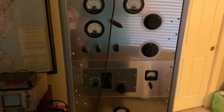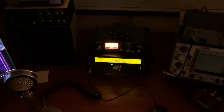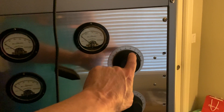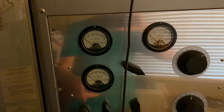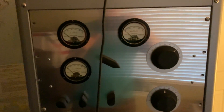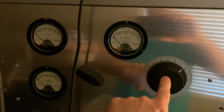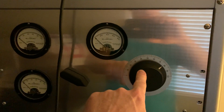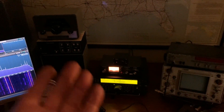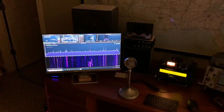Plus I have the pan adapter now. This is always going to be my main transmitter here of course. I'll use this for AM and I'll use this on SSB — I doubt if I'll ever use this on AM. I might use it on the higher bands until I eventually get it — I need to change this out to a vacuum variable cap. When I do that I can get this working up to 17 meters because this exciter will go to 17 easy. I just can't tune the RF amp — it's too touchy with this big air variable cap with those huge plates. I've got to change it out to a vacuum variable. When I do that I can make this work all the way up to 17. This will be my SSB station, and for now I'll use it on 20 and 17, maybe 10 on AM until I get this thing fully finished. So that's it for now. This is W5HRO, 73s.